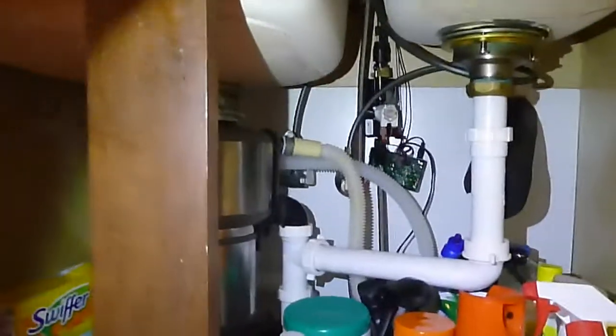This is the kitchen sink. This is called a foul line — F-O-U-L. It's supposed to cascade down like this; you're not supposed to have that configuration — that's where bacteria collects. I don't have a drain stopper for the garbage disposal. The dishwasher drain line does not come up and meet the kitchen sink, so we don't really have a good anti-syphoning device.